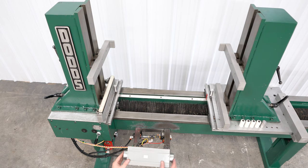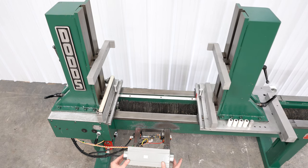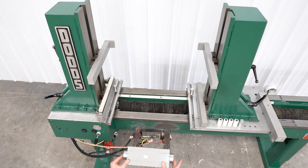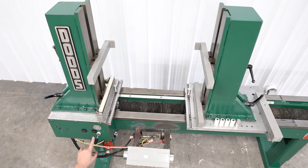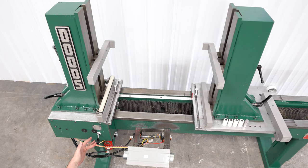This is a dual palm operating machine. For safety, to close your jaws, you do have to use both of your hands. This machine has a little bit newer logic than it was originally built with. Your solenoid switch in here is brand new. There is no close on the joystick — the logic will not allow you to close it, so your operator can't stick his hand in and close it. You use the joystick simply to open; that is the only function of the joystick.